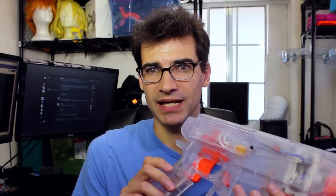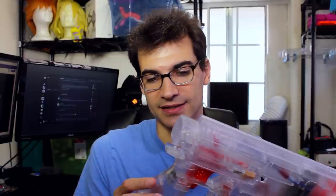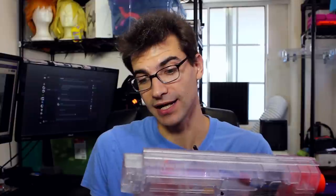The switch plate here, while a smart idea, I don't like that they went with the smaller size switch — like the DC2 Cherry. I would have preferred a full 21-amp Omron switch plate, something like the Out of Darts switch plate, because I'm actually a little concerned running the small switch in here — I believe it's a 12-amp switch.